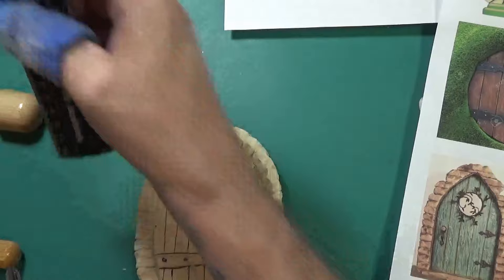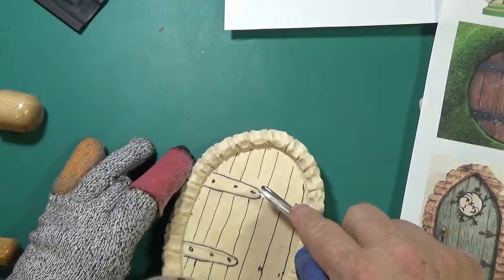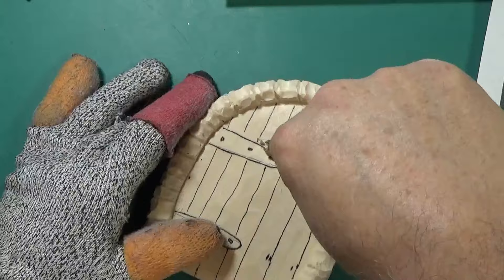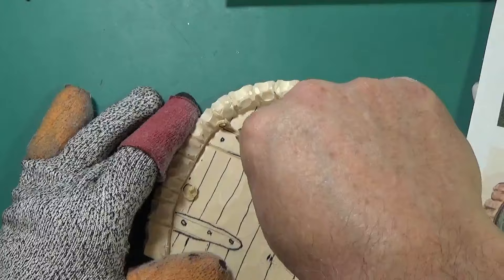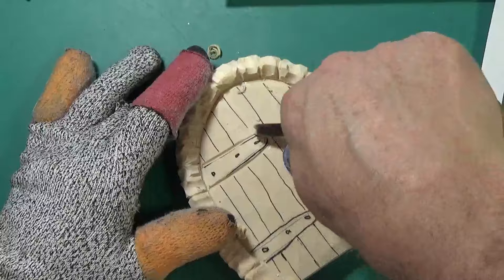Measuring is problematic because we've got inches and centimeters - it looks like it's about 5 millimeters across, roughly about a quarter inch. I'm going to zoom in a little and go right across grain, staying outside the lines I drew because I don't want the hinge to be any smaller than that. Just carving those in - you can make them as deep as you want, these don't have to be very deep. Going around the corner is a little tricky so I'm making sure I'm holding it well, just letting the V-tool follow the line to match the contour.